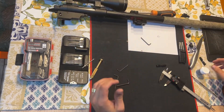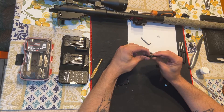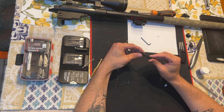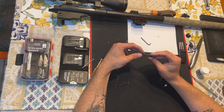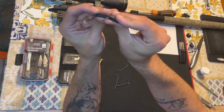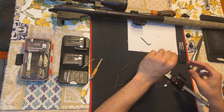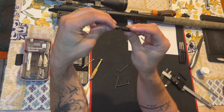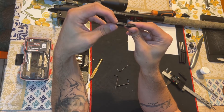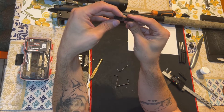The main parts that I had problems with were the hop-up arm, because being made out of PLA even with 100% infill there are still small parts that are very slim and will attempt to break — as you can see, the first attempt broke unfortunately. So I remade the arm, keeping in mind to place a nut that I had to grind since I couldn't find a square nut in my local store.